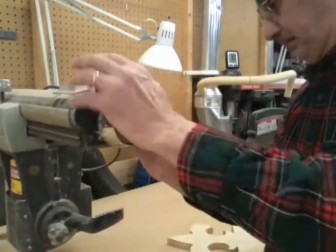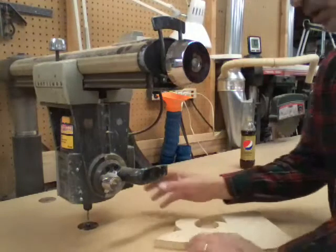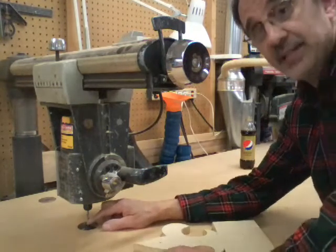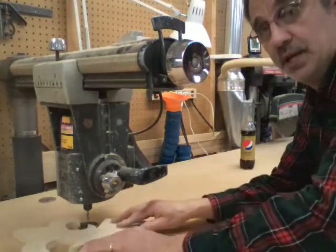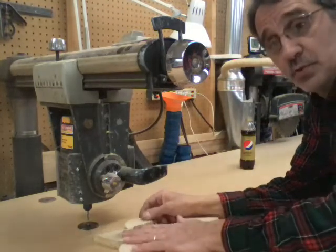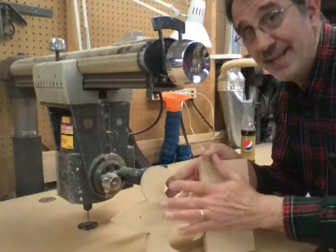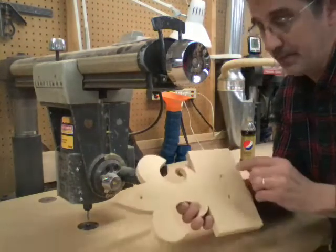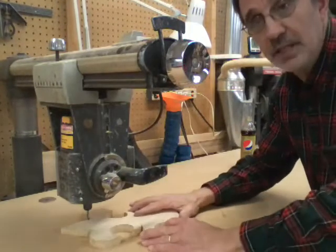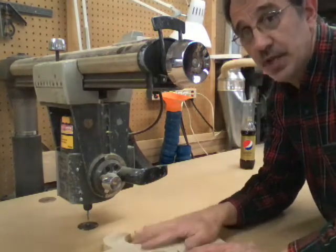You line this up, move it back into place, and the router bit lines up exactly over the top of the pin. It has to be lined up right — as you go around the pin it's going to make a staggered cut if it's not. So you've got to take your time and get it lined up. You've got your pattern screwed to your blank piece of plywood — or whatever you're going to use, even a piece of plastic. You put the pattern down, that's why you need chamfers for the screws so the heads can't stick out past the face. You just shove it in against the pin and go around the pattern, and it will cut this out exactly the size and shape of your pattern.